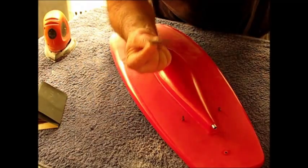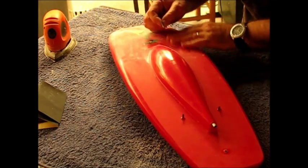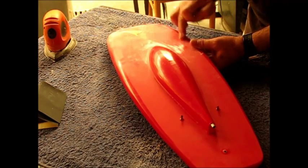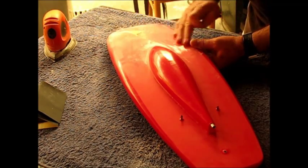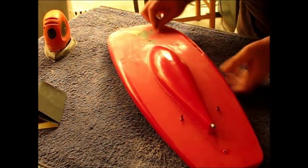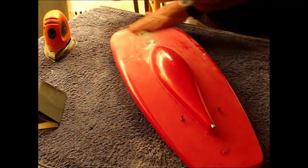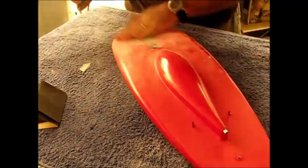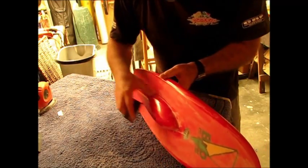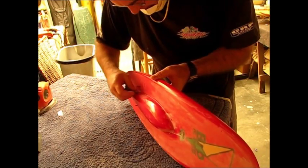What I like to do on the small high spots is just take the blade and flatten them down. It just isolates the area, because sometimes if you try and sand a little high spot down you could end up sanding around that high spot and going through your clear resin. So just for the initial stages, use your blade to remove the necessary high spots. With the 150 cloth, all I'm doing is just removing any of the high spots and cutting them off.